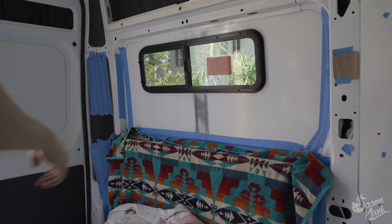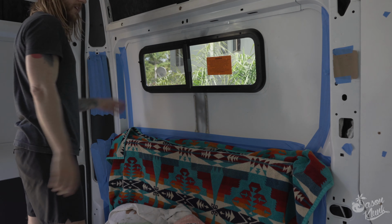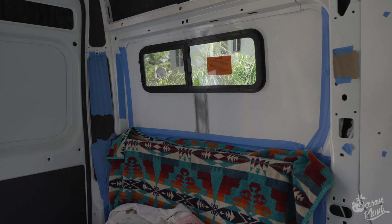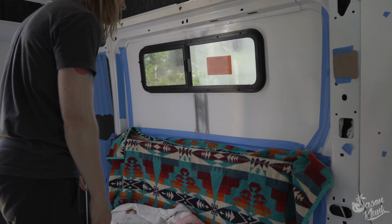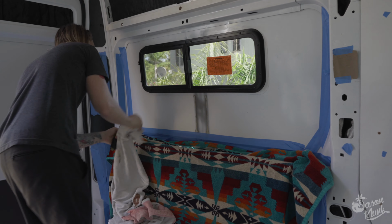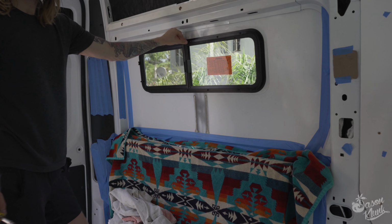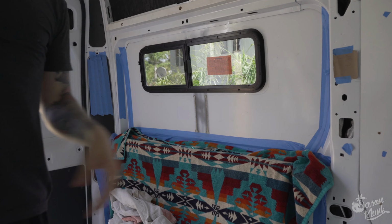Got the window in, hand tightened all of the screws around. Started them with the drill first, low torque, and then hand tightened so I didn't strip them out. So we're gonna do a spray test quick. Looks like all the outside seams are fine, but just right in here, I don't know if it's coming, if the window's bad or if the seam isn't tight enough.